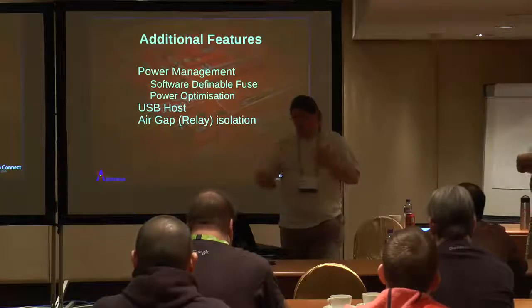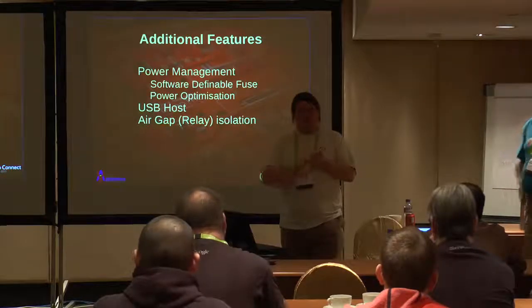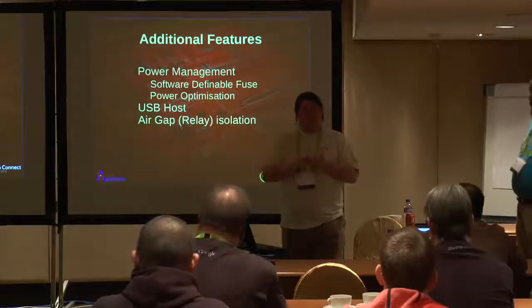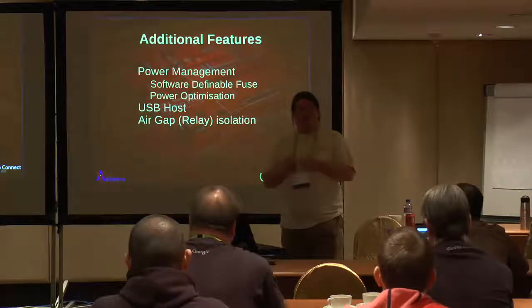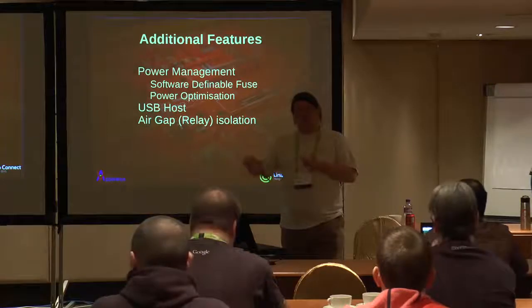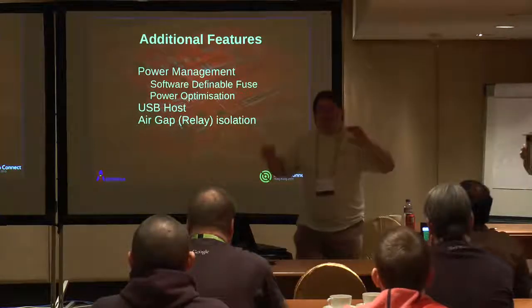How do you get the power data? So we have a host micro, which is providing our serial terminal services. It's providing a USB terminal server. It's nothing fantastic. It's a little BeagleBone Black, but the power monitoring Coulomb counters are all on the I2C bus up there. But it's all logged, right? Yeah. So it will all be logged with the software.